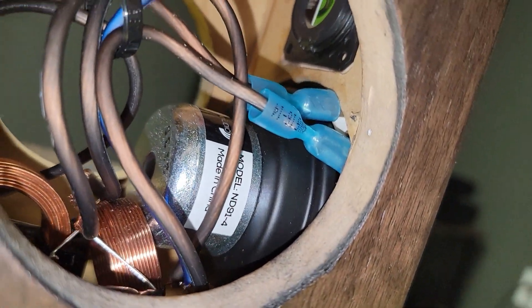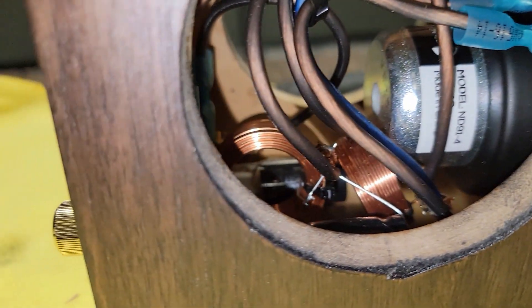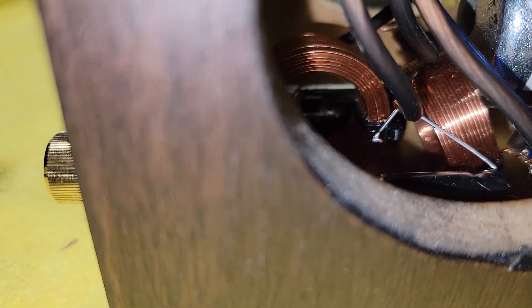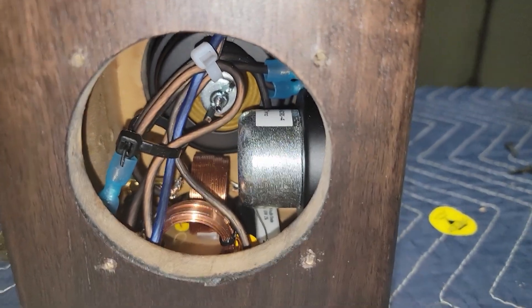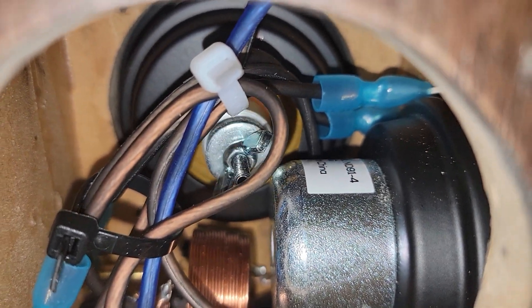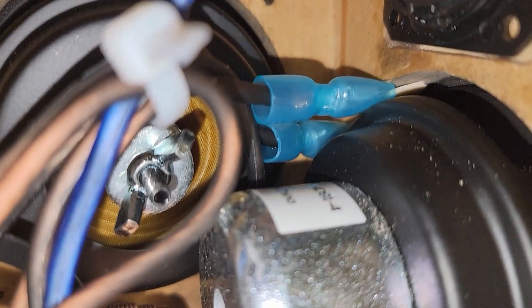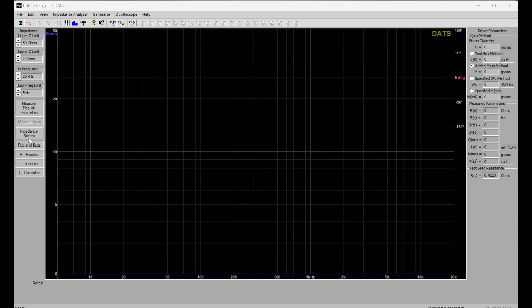The astute among you will notice that the first crossover was jammed right into an inductor — that Neo magnet not only pushing it over but sitting right up next to it. How I filmed this and didn't notice, I have no idea. Let's get these out and reorient them. Now we've got a much better alignment, though still a really tight fit. Make sure passive radiators aren't bumping into any wire, and be careful — with that wing nut swapped around it will bump into the magnet.